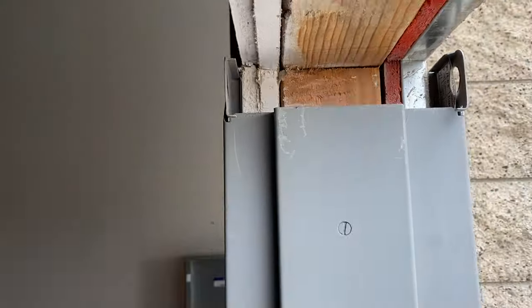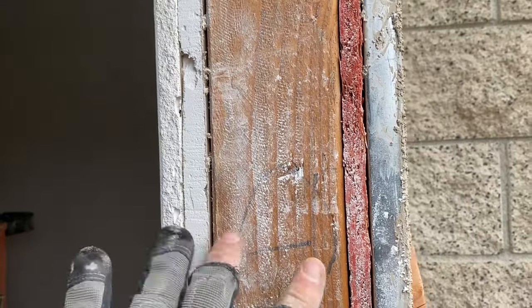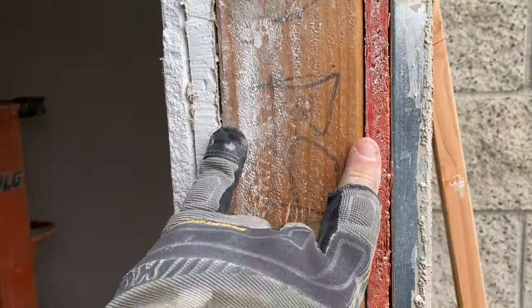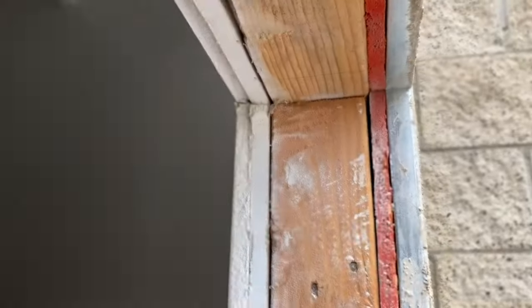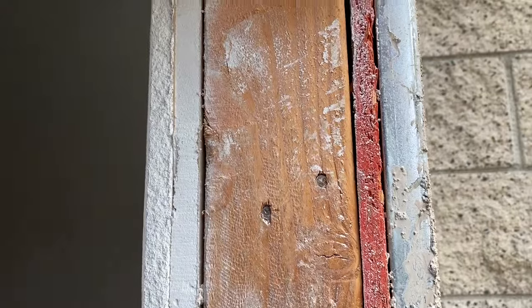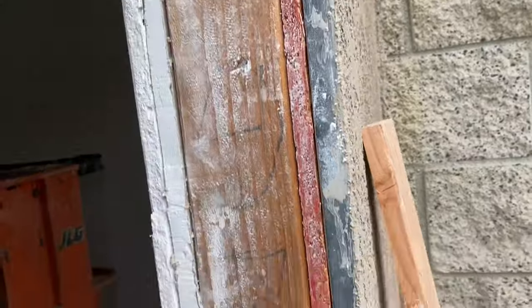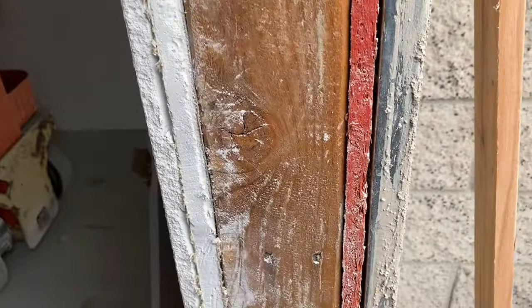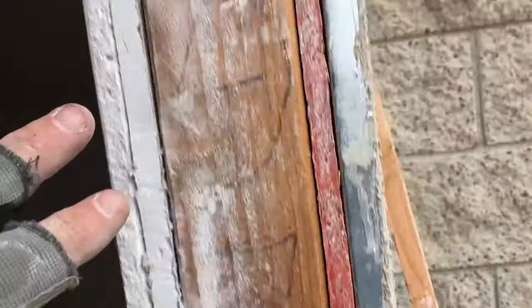I cut out that chunk of concrete and added another strip of drywall — they have drywallers coming in, and that'll just pop into place and stay, which is great. Now this is an exterior jamb, so all of this should be waterproof — covered with some sort of flashing paper, moisture stop, something. They are aware of that; they just want me to put the doors in. They said they're going to build a little alcove here, so this will actually be cut. But if it wasn't, you'd definitely want to waterproof all of this first.